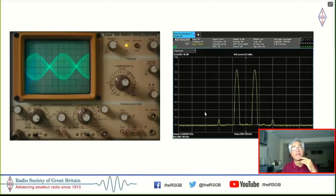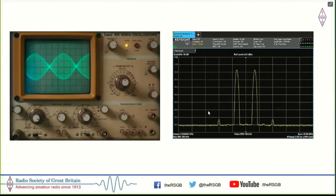So it's very simply this, that we hams tend to view signals in frequency domain. By that, what I mean is that I say that my VFO is oscillating at 5 megahertz, or I say, I'll see you down at 7040 kilohertz, or whatever. So we essentially do not talk in terms of time domain, but we look at the band, we perceive the band as a spectrum of frequencies. So if you see the signal on the left, it's a two-tone signal, which you see on an oscilloscope, which is how we deal with them when we are building an analog radio. But if you see it on a spectrum analyzer, you see what you see on the right-hand side, which is in frequency domain.